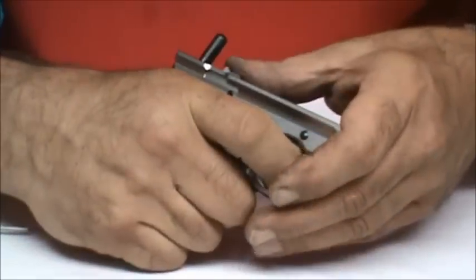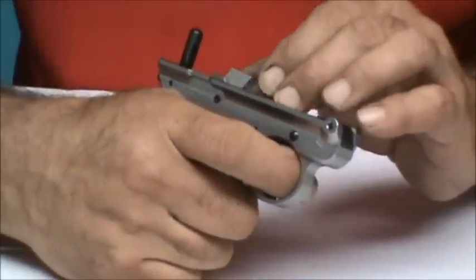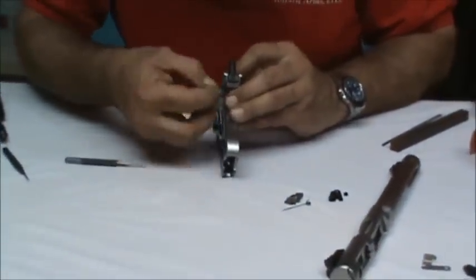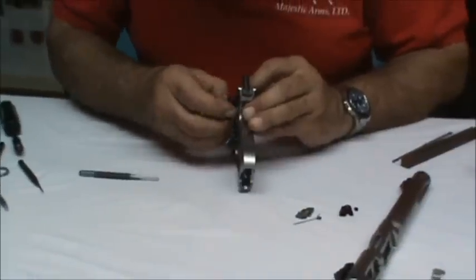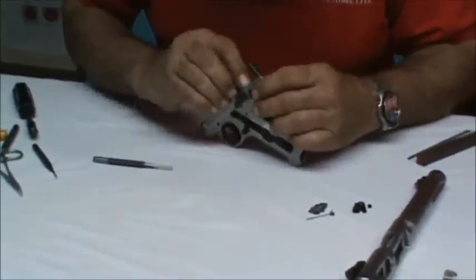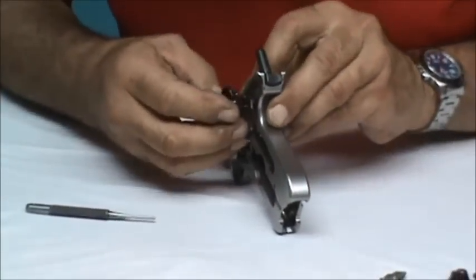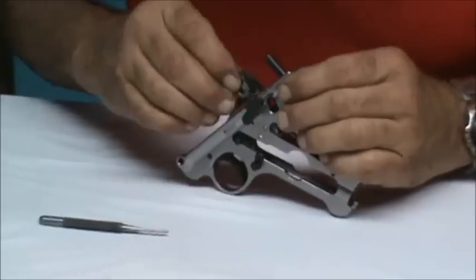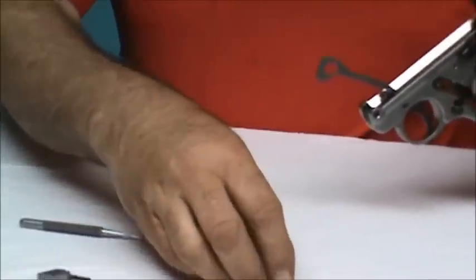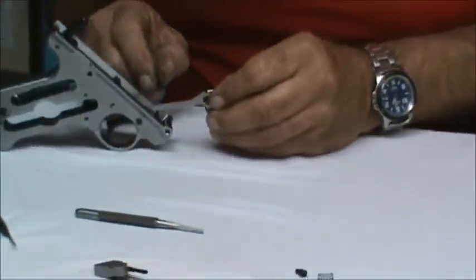She's still hanging up just a little bit — that means we want one more thousandth. Remember, if you quickly release the trigger the bar will jump into place, but you want to slowly and gently do it to make sure you've got enough clearance for that bar to always get back up behind the sear. I'm drawing the safety out enough to release the hammer but not enough to make the internal safety piece fall out. I'm going to take out the spring and plunger and give this maybe two thousandths of an inch more clearance — finish it up with the stone and we should be good to go.